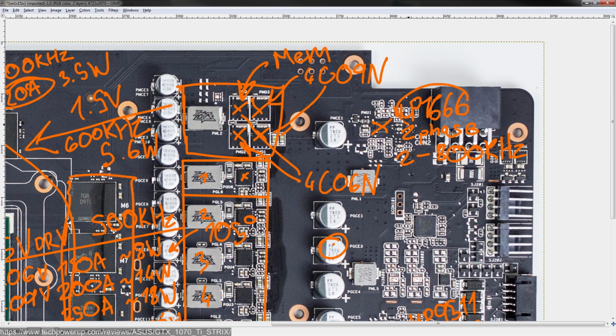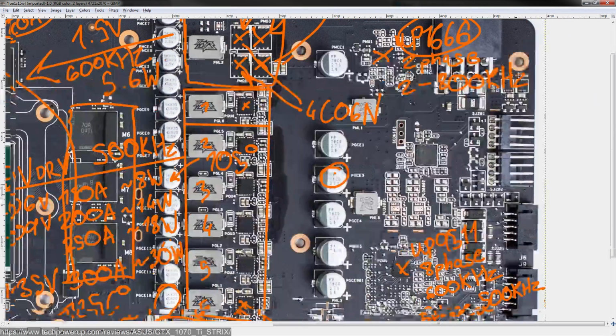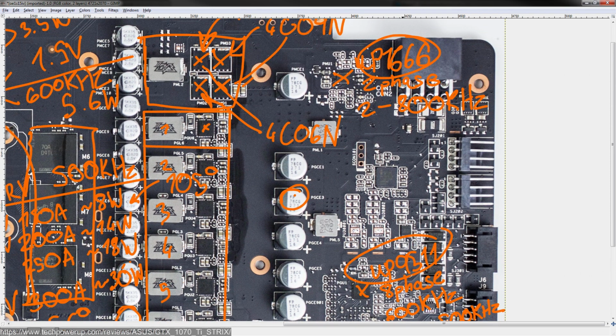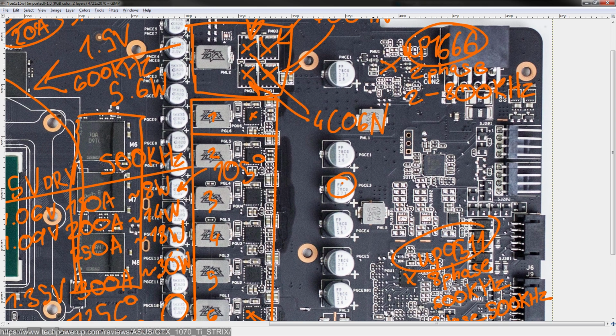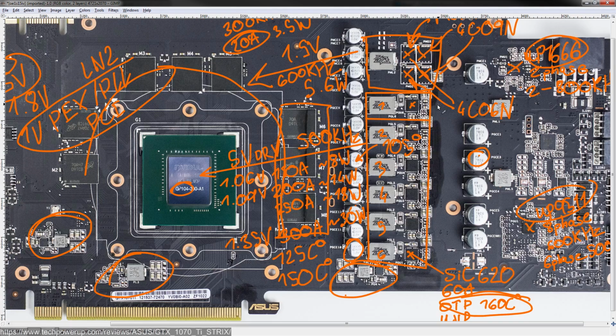Other specs on the UP1666: since it's on an NVIDIA card, it has the same control capabilities as the UP9511, so a PWM signal goes into the chip, and that is used to generate the memory voltage. Not much else to it. Similarly, all the actual settings on the chip are configured with resistors around it, and there's no software monitoring for it.